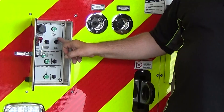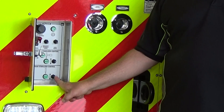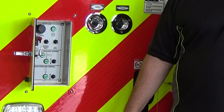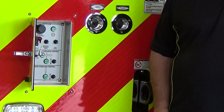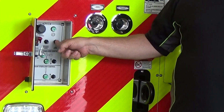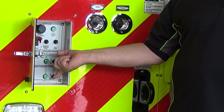Level assist — this switch, in my opinion, should be here, and this switch should be up here. Because when you set up a truck, you do not hold this switch at all. You would think you would, because if you're looking at it and you want to set up your stabilizer, that seems natural. But no, you never hold that one. At least they could have numbered them for you — one, you run it out; two, you lower it; three, you hold this one. This is just for after the fact if you need to make adjustments, or when you're putting it away. This one must come up first when you put it away.